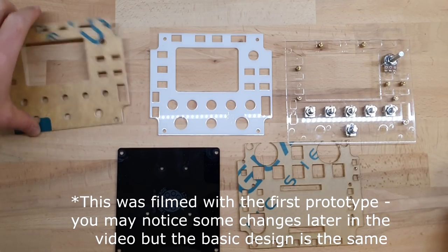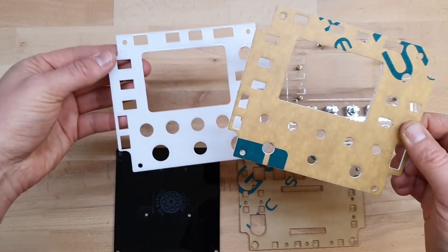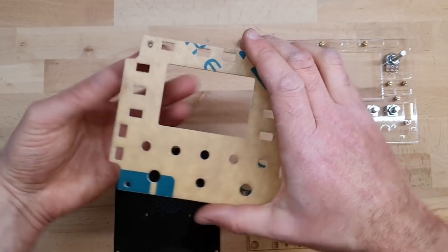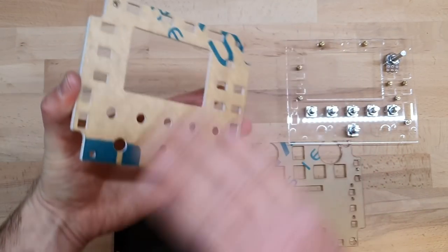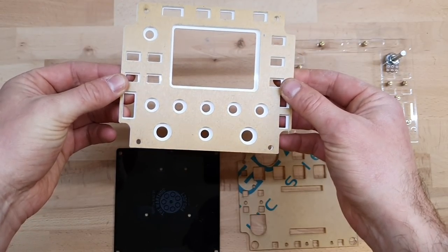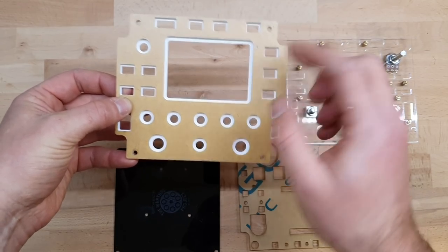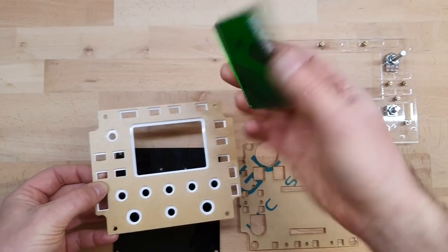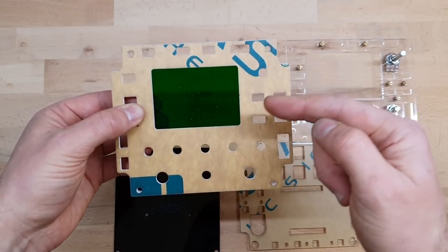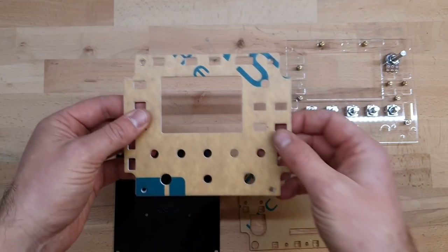Here's the panel fresh out of the laser. The top plate is 2mm thick white acrylic - it gets glued to the translucent white spacer for the backlight. After gluing those two together I'll sand it and hit it with black. You can see the holes on one side are larger to hide the nuts of all the components and retain the switches. It also retains this green transparent cover which will protect the LCD. I've done it green but I've got a clear one as well - I'll try green first and see what it looks like.